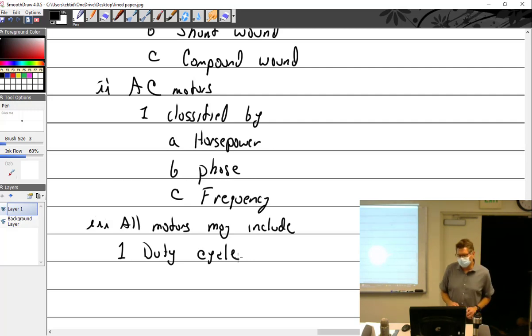So a duty cycle is how often you can use it, like per minute, but then it must rest. So you may look in the pilot's operating handbook and it says do not extend and retract the gear more than once every 3 minutes or something like that. We put a self-imposed duty cycle on there. Landing gear motors will often have that. Definitely starters. Do you remember what it was on that one? 30 seconds for every 5 minutes on the starter that we have here, because it's one of those newer lightweight starters and they don't dissipate heat real well. So you have to be very aware of the duty cycle of what you're doing there.